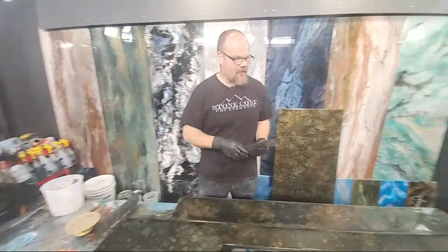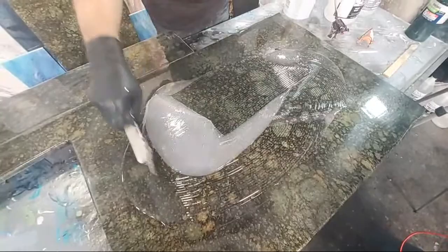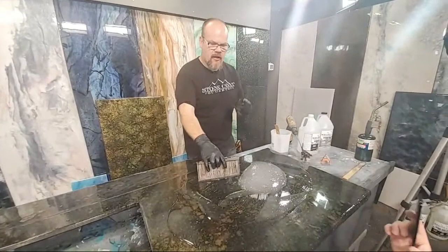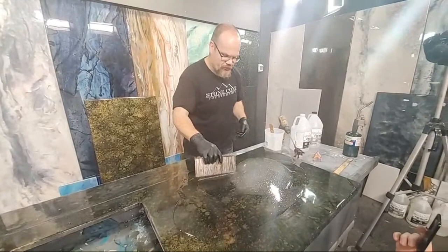Where I scraped all that out, I'm going to use that trowel to really mix it so that I know I have a thorough mix. You can also see that the epoxy has a little air in it from whipping it up with the drill. A lot of epoxy is going to set up and start to gel and harden on you if you're not done with your project, but this has a long open time, so I have plenty of time to get that air out. I'll show you how we torch that — it's as simple as one, two, three.